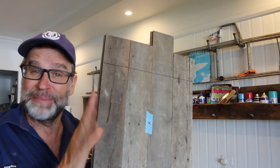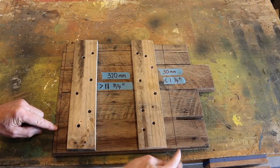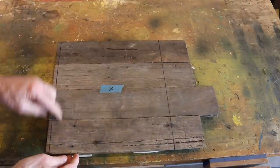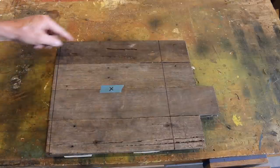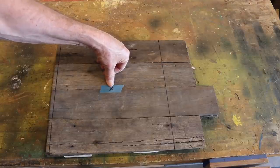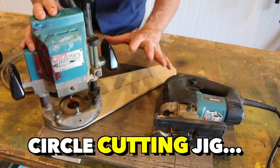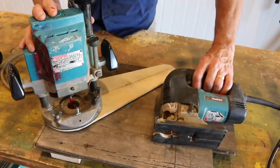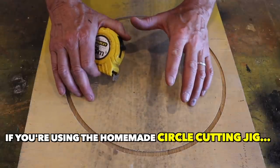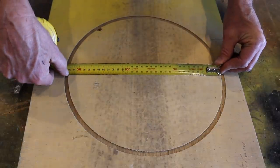With the seat now glued up, our next mission is to cut this into a circle. Just transfer those two outside black marks to the front of the seat, draw a line from corner to corner, and where the two lines intersect — that's our center — mark that with an X. I'll be cutting my circle out with my router complete with my homemade circle cutting jig, but if you don't have this setup, don't panic — a jigsaw will do the trick nicely. Just a quick tip: before you get to the point of no return, get yourself a piece of scrap and do a test run to make sure you've got the right dimension.